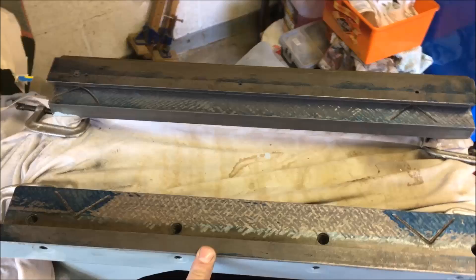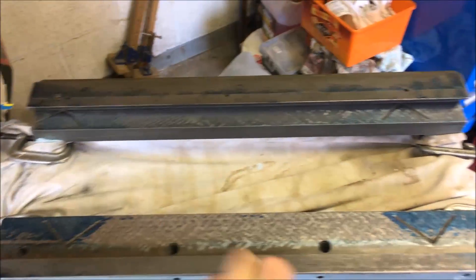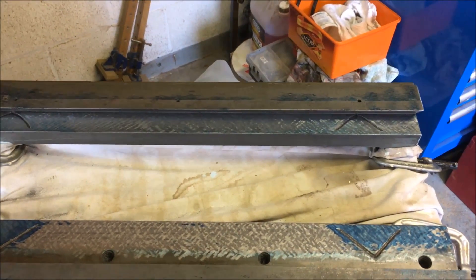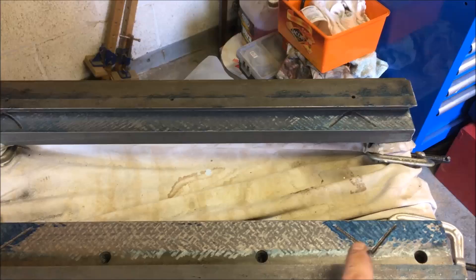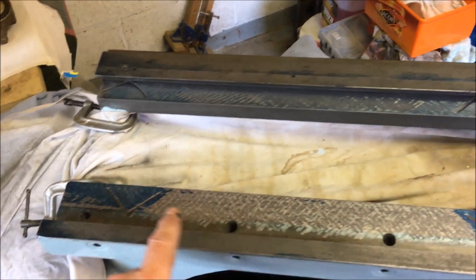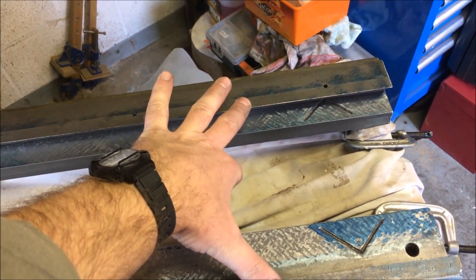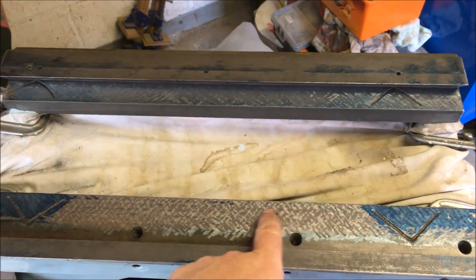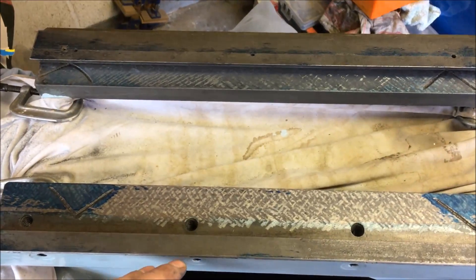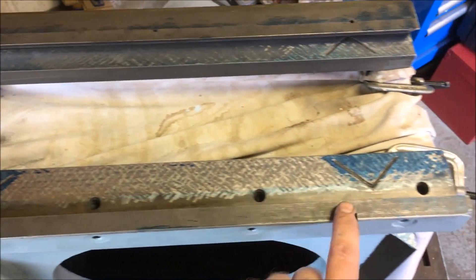I made a bit of a mess printing, but I tried with the ram first just to give me an idea and got pickup there and there — which are the two load points according to the measurements. I then pulled out the straight edge, took a light printing, got a repeat, put a heavier ink on, and you can see I've got pickup there and pickup there but nothing in the middle. When I'm measuring across from here to there, all of this area should still be a third of a thou higher than that area — I have no idea what's going on.